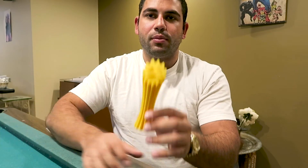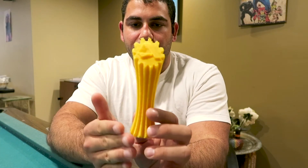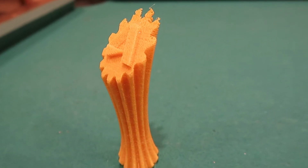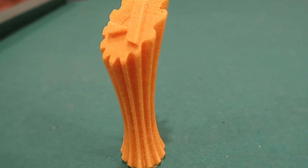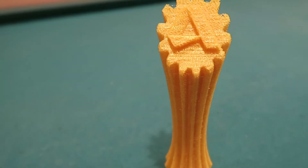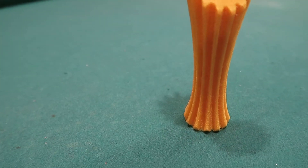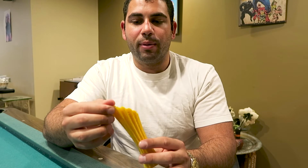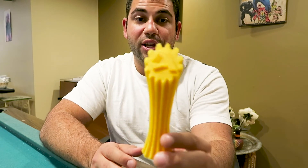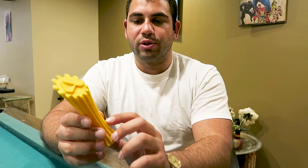At the very end I printed with the orientation straight up vertically. The main fear was that since this is such a long tall piece, it could have moved at any point and wasted the 12 hours the piece takes to print. I didn't have a lot of that time when I entered the Autodesk competition, so I played it safe and laid it flat that time. But this vertical one, as you can tell, came out really well — no problems with skewing or anything.